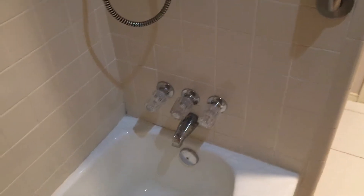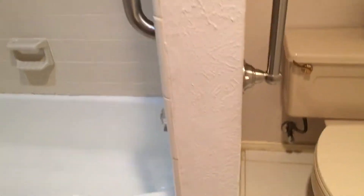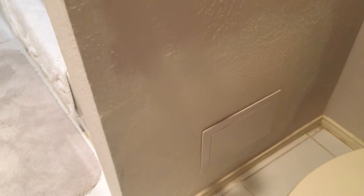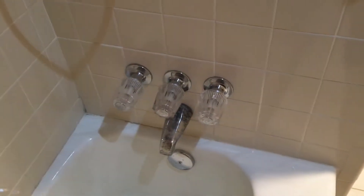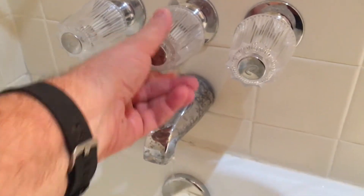One suggestion was that inside this wall here, I've got the valve — and I'll show you, it's fairly accessible. You can see there's the valves, the wall, and the shower. There's even an access panel in this wall to get into the drain, which I've actually been into recently replacing the stopper. But it was suggested by a local plumbing supply company that I may actually have a cracked valve — in other words, the unit up inside the wall may have a small hairline crack that's not letting the water divert properly from the tub up to the shower head.